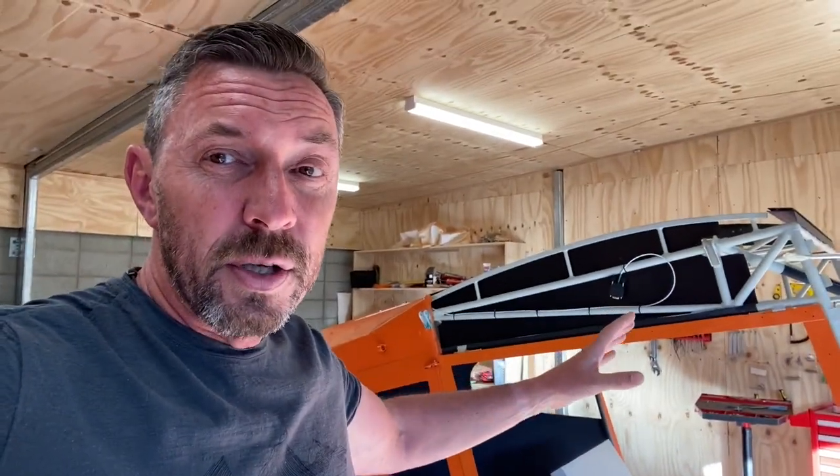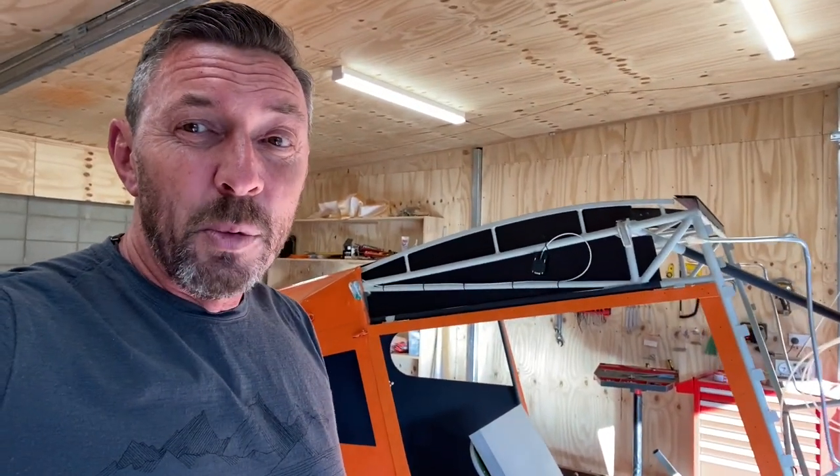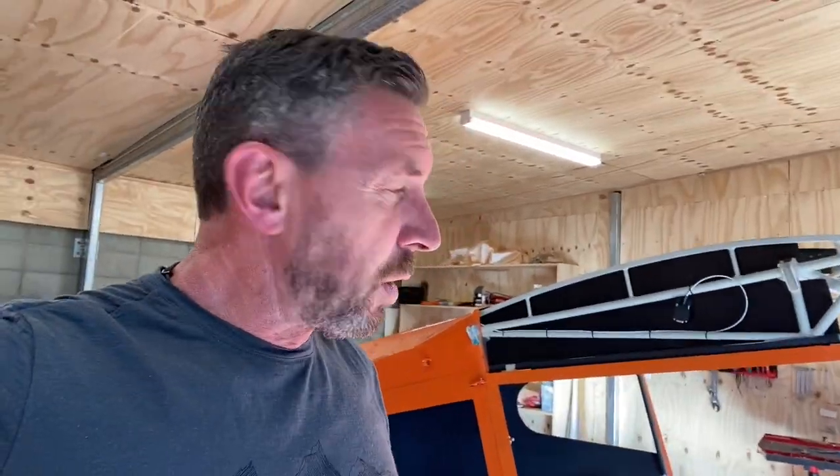What I'm trying to say is that I've kept the whole cabin pretty light, and the only increase is due to the kydex - and it's very close to the center of gravity of the aircraft, so I think that should go reasonably well. It's food for thought. Personally I found it very very good to fabricate - you can grind it, cut it easily with scissors or shears, use a dremel tool on it, and it sands quite well. Just very very easy to work with.